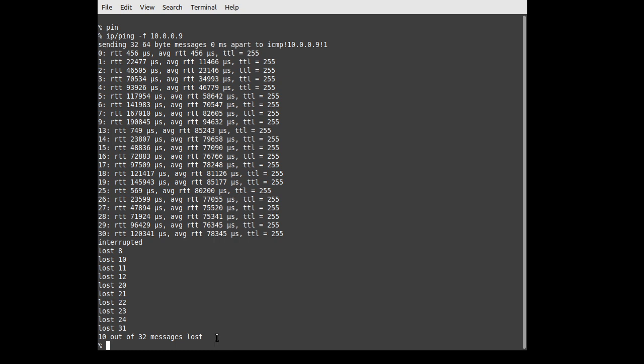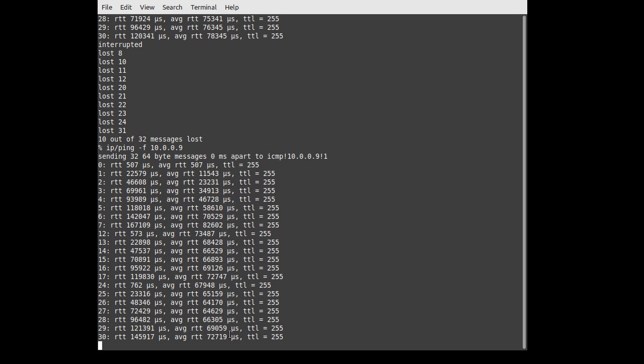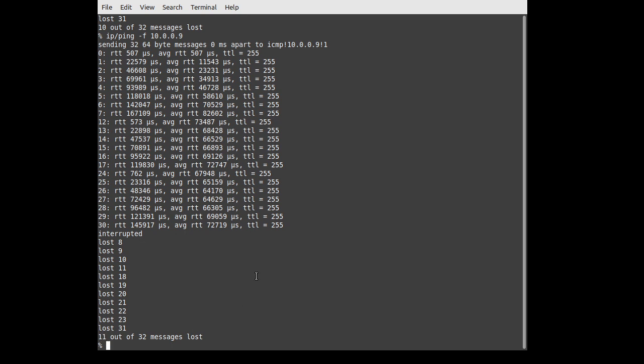And this is also a gigabit interface. I think right now it's only running at 100 megabits. I deliberately put a 4-core cable on here to force it down that way. Gigabit Ethernet's actually pretty quick, so there's some extra timings and stuff that have to be set. It can be quite a bit more fiddly. But yeah, 30% packet loss isn't really very useful. Oh, this one looks like it ran a little bit better. Nope, the same. So yeah, there's a little bit more to play with that. There's definitely a lot of moving parts in an Ethernet driver.